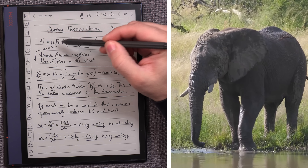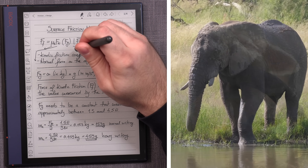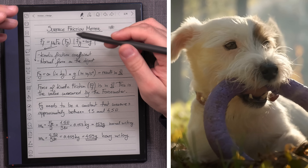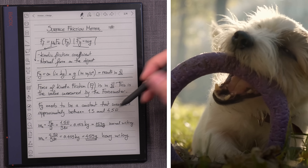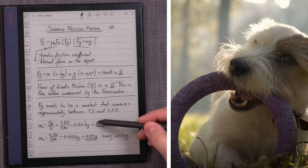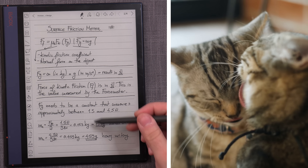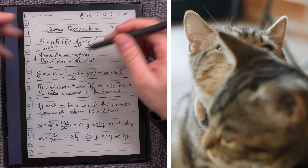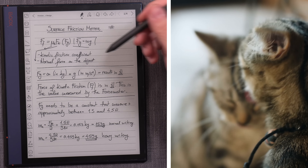Basically, the normal force is the force that the pen is pressing down onto the screen. I did a lot of research and found a Japanese study on handwriting forces and habits, which precisely measured that normal writing equals about 1.5 Newtons — roughly 153 grams after gravity conversion — and heavy writing equals 459 grams. My goal was to have a consistent force pressing down, holding one or two nibs at approximately 150 grams or a little more.